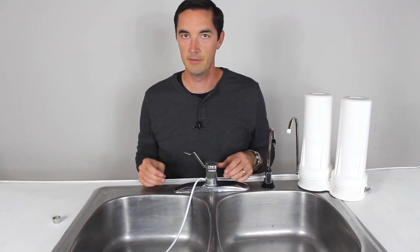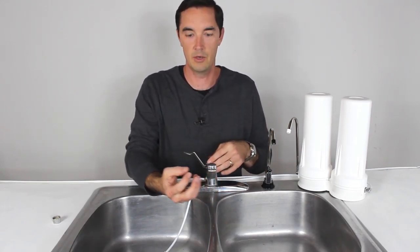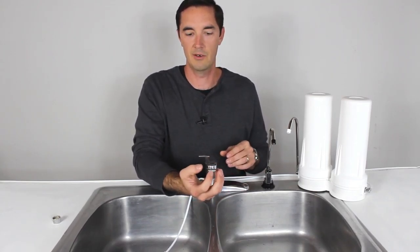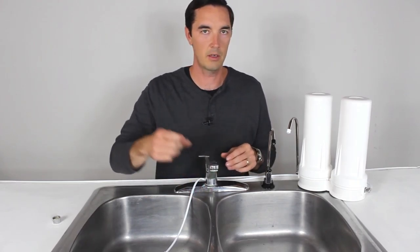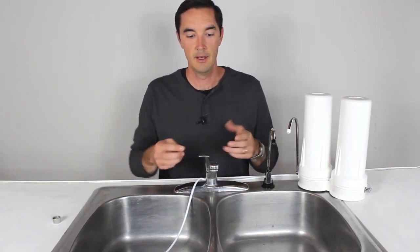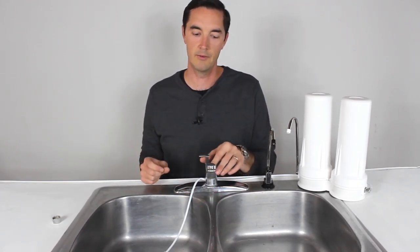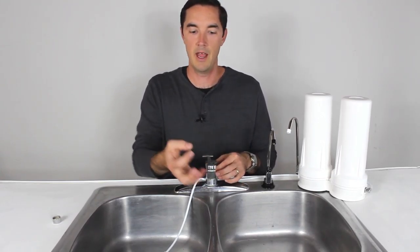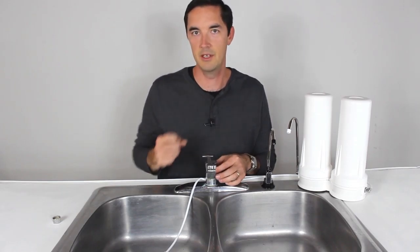If you're in the small percentage of people where it doesn't come off easily, the first thing to do is use pliers. Wrap a towel or a rag on the faucet so you don't scratch the finish, give it a good twist counterclockwise, and it should come off. If it doesn't, let's look at why. If it's a rust situation, you'll need something like WD-40 to spray on there and let it work down through the threading. Or you can run really hot water for a while — that'll expand the metal a bit and maybe break that seal.